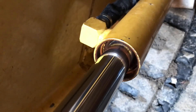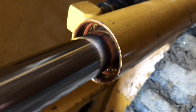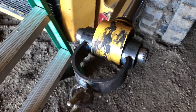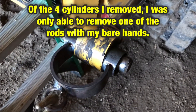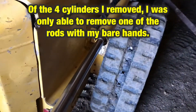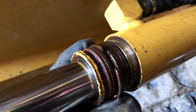Once that ring is in position, it lays flat and provides a way for the internal snap ring to glide through that groove so you can get the end cap out. I got the end of the cylinder disconnected from the machine — you can see the little plastic spacer in the snap ring groove. Here's a tool I made to help pull the rod out. You put a little tension on the line and tap it with a hammer while providing some tension.